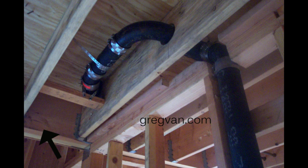If you're going to build a room addition or a new house, make sure — and I know most framers don't even get along with plumbers because they're tired of these guys tearing up their floor joists, just like you're seeing here. I'm not going to suggest this is breaking any building codes, but look at the size of that hole. As the framer or home builder, if you move this floor joist over and install another floor joist next to the wall, you make it easier for everyone.